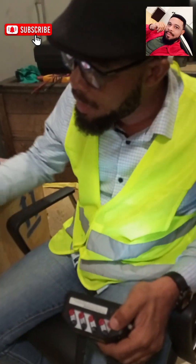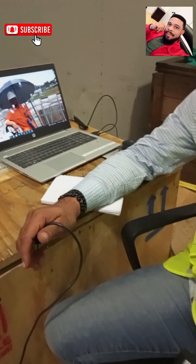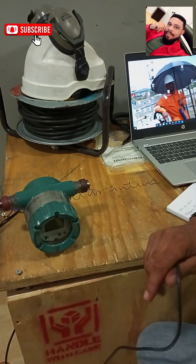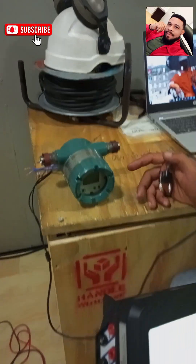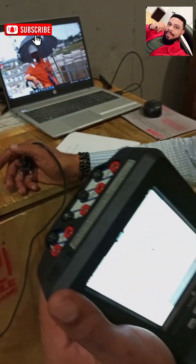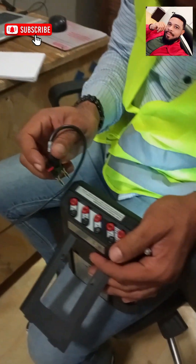As I always explain, this transmitter has no external power supply coming in — there is no 24-volt DC power supply currently powering this transmitter. So how do we power it? I'll be using the Trex to also power the transmitter.